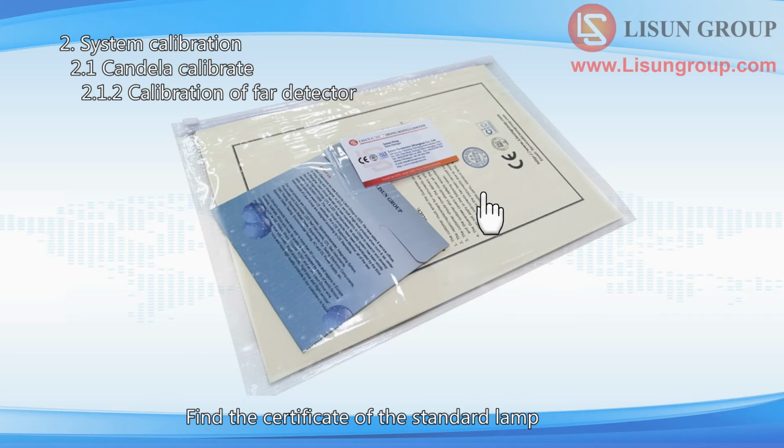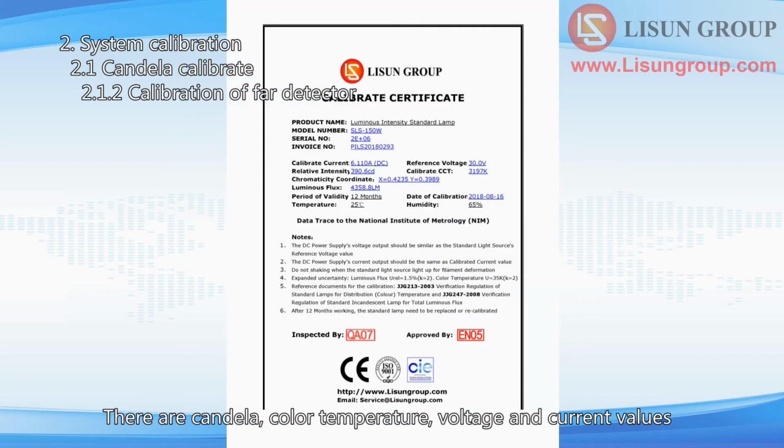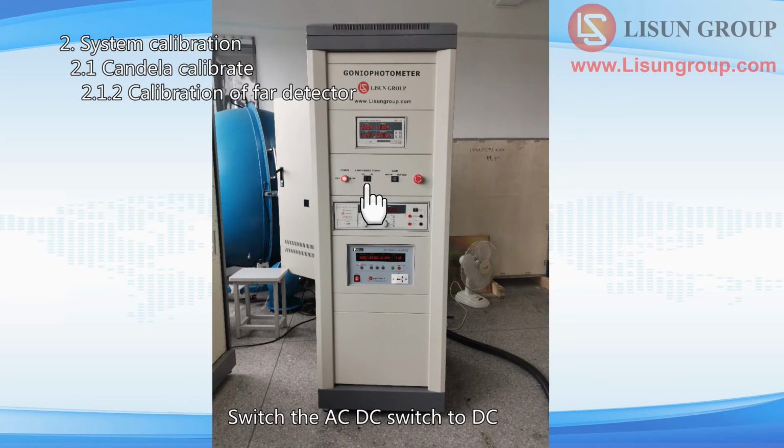Find the certificate of the standard lamp. There are candela, color temperature, voltage, and current values. LSG standard lamps are all constant current DC lamps. Switch the AC-DC switch to DC.